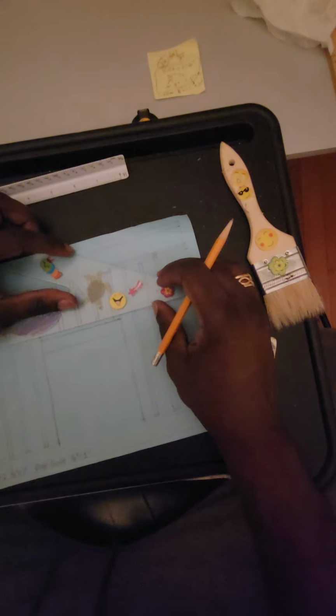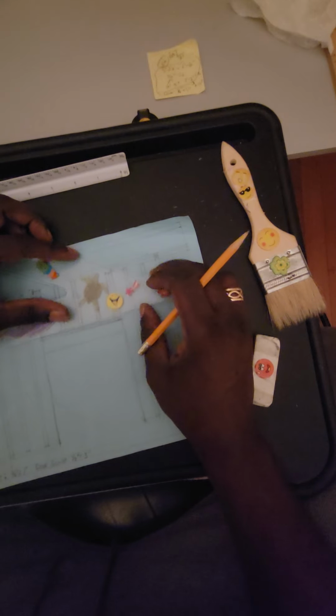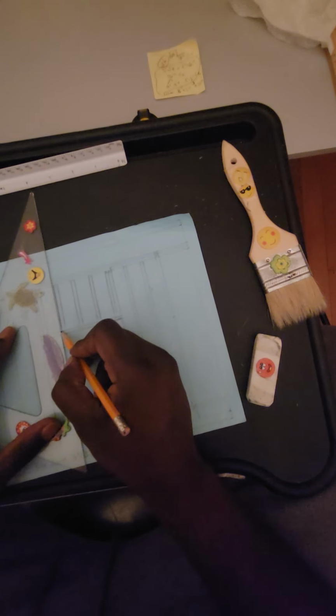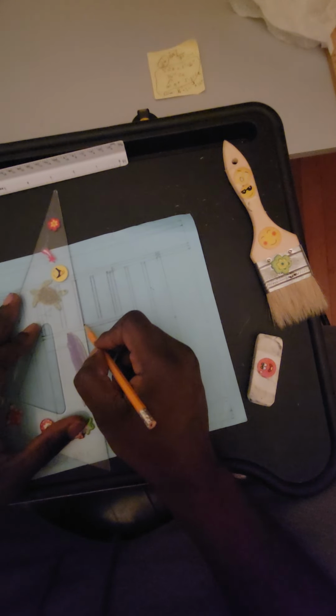But on job sites, guys and girls don't want that. They're like, no, man, it's a waste of time. I'm like, okay. Sometimes on job sites people want that. But again, it's preference at this point. I think it has also added structure to a member. And this 2x4 is just there for the purpose of giving these top cripples, door cripples, something to nail to, instead of just toenailing into the 1.5.